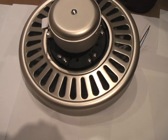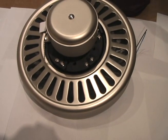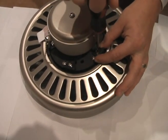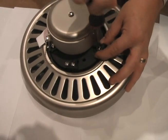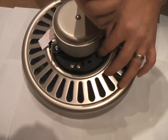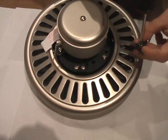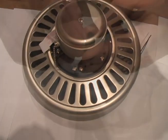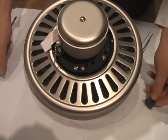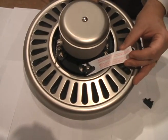The next step in prepping the motor to be hung is to remove the shipping chucks. These chucks are in place to hold the motor from bouncing around during shipment — these are the little rubber chucks that you see here. Simply take these motor screws out; you'll need these motor screws to put the blades back onto the fan motor. You simply remove your nut from your shipping chuck. The fans do come with a safety label asking you to remove these.